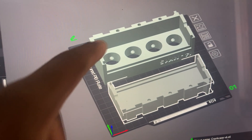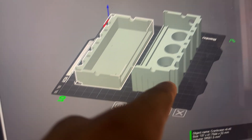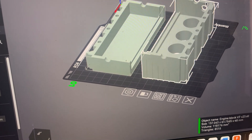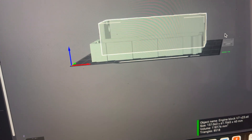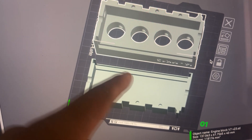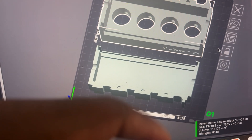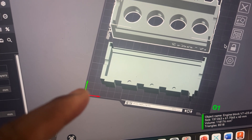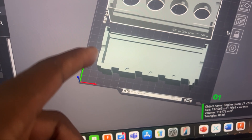Now that the pistons are done, I'm moving on to the body. I removed one of the holes on that side and changed the text to say mark 13 instead of 12, because it's now for my new crankshaft design. I also changed the hole diameter to 24.15 instead of 25.15, because I accidentally made the pistons 24mm instead of 25mm. Rather than redoing all the pistons, I just made the hole slightly smaller. I can always increase it by a millimeter — it's not difficult. Now I'm sending it to the print bed.